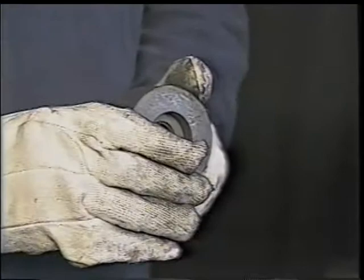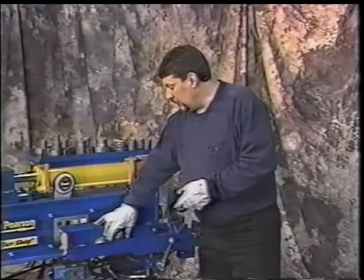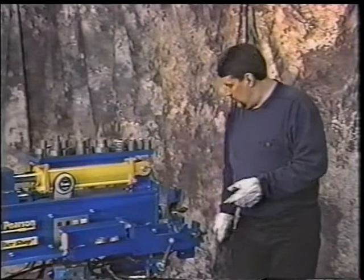And then you have your other sizes, your solid segments for your other ball flares. And it's notated on here like 1 3/4 and 2 inch, 2 1/2 inch, okay? So all these solid die segments you have are right in the nice trays, easy access, and again, you've got the shut off of the machine right here at the back.